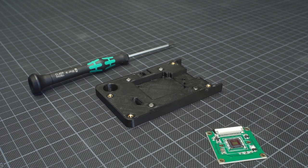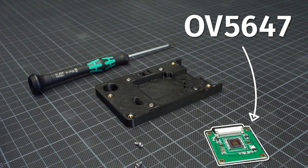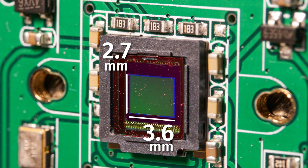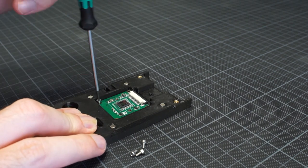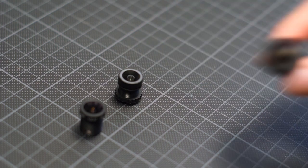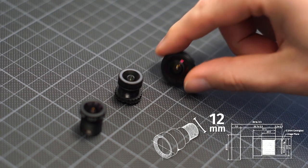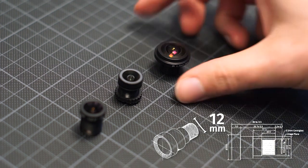So that's exactly what I'm doing. This is the OV5647, a tiny sensor also known as the Raspberry Pi camera chip version 1 — 3.6 x 2.7 mm with a whopping 5 megapixels. The big advantage of such a small sensor is that it's easy to fit into a camera and we can use these tiny M12 lenses. You'll usually find these on security cameras or machine vision stuff. The aperture is fixed and they come with a 12mm screw thread. For focusing, you just screw it closer to the sensor or unscrew it, and you can cut a thread into 3D printed plastic as a mount.